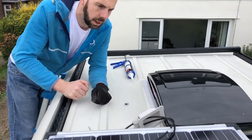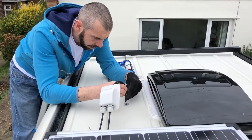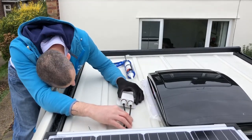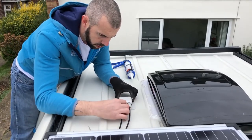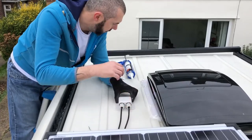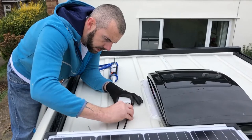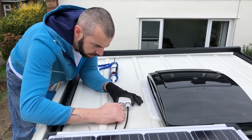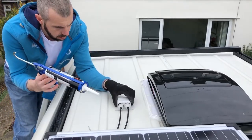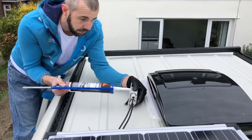I've Hammerited the edges and I'm just going to feed the cables through. Bad news is it's started raining a little bit. I'll pull this to where I want it and tighten those up. I've already degreased the top of the roof, so now I'm going to flex that down with a little more slack on the cables because it's pulling the entry offline. I'll pull this through to get a bit more slack so it won't pull on the nodule and will let it sit flat. There's a good seal of Sikaflex here.